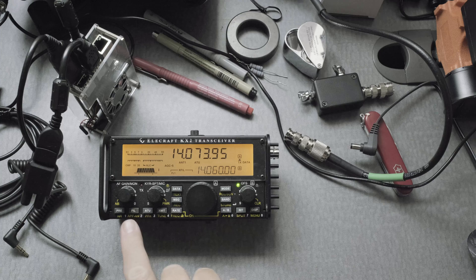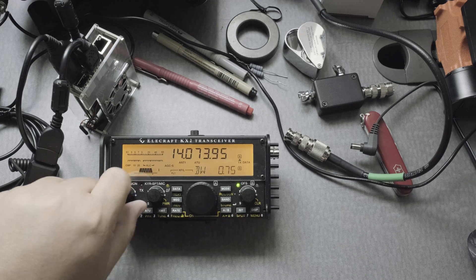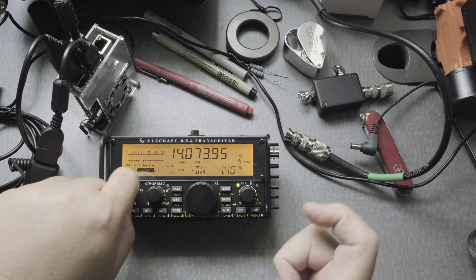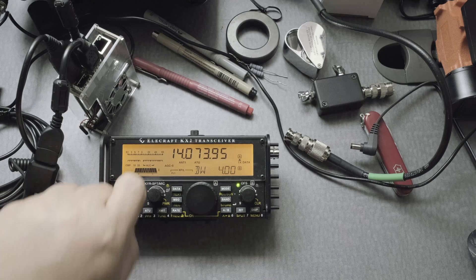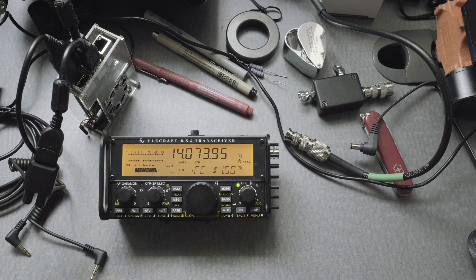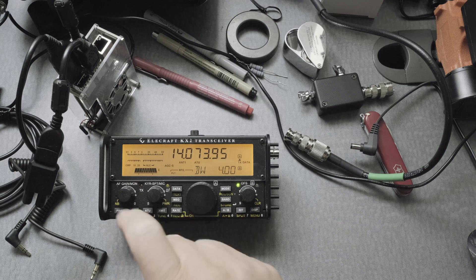Something you also need to do is the filter. Click and adjust the width all the way wide — to about four. And then the center needs to be at 1.5 using the mic dial. Sometimes when you do this and put it on your computer, the data doesn't seem spread out all the way when looking at something like WSJTX or FT8. If that happens, click on the filter and just redo it — that's a tip that might help you out.